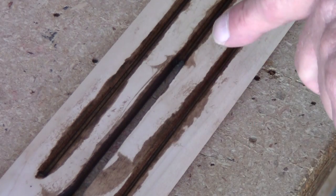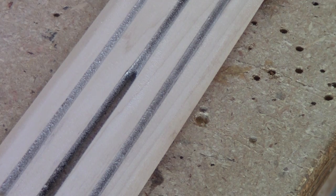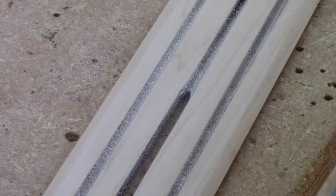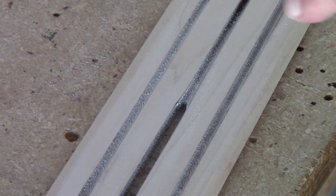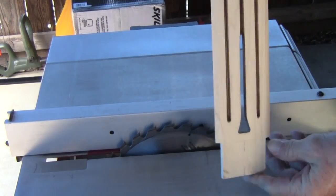I already put one coat of walnut stain inside the V-grooves, but it's not quite dark enough. I took a small narrow brush, put it in the very end, pushed it down, and drew it back. I let it sit for about 20 minutes. Now I'll show you how to sand off the parts that went outside the area. After about 20 minutes I went over it again with 150 grit — go over the whole entire blade like that, then take some air to blow it off. You can fine-touch it if needed, then do both sides. That completes the staining of the lines.